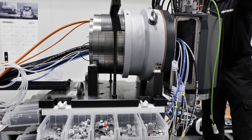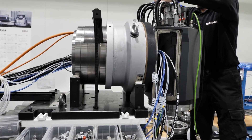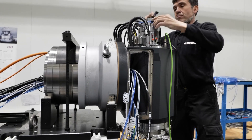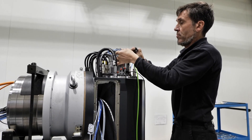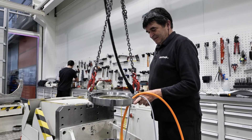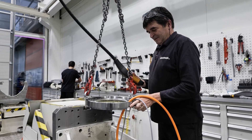Regarding the award-winning technology in the spindle, we can focus on two aspects. The B-axis uses Ibarmia's own direct torque motor technology with no gear transmission. We are talking about a really fast, very powerful B-axis — up to 8,000 Nm in blocking capacity — enabling continuous 5-axis machining.